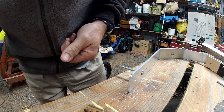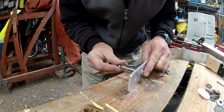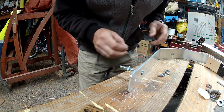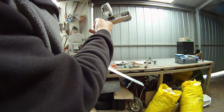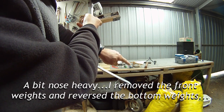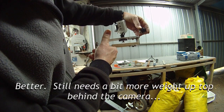I don't have any suitable washers for this at the moment, so I'm going to use some unsuitable washers until I can get an idea of what weight I need. Then I might cut a bit of aluminium rod approximately the right weight with a quarter-inch hole straight through, and use that as the weights. I'll turn this nut around and put the weights out here and see what happens — and that must be right at the front.